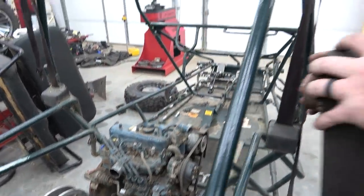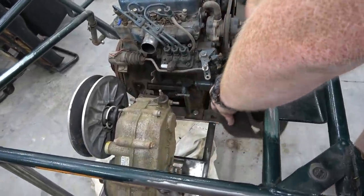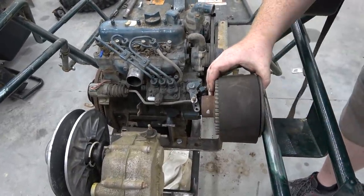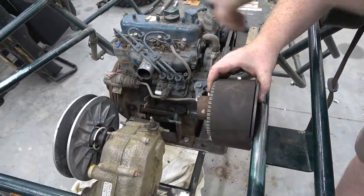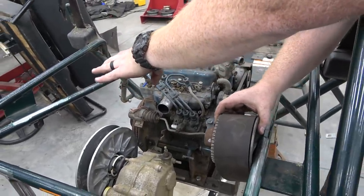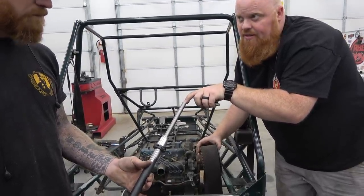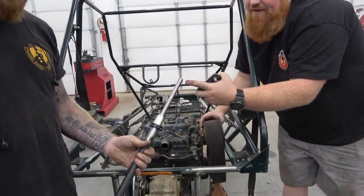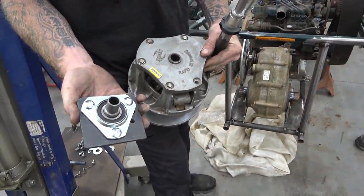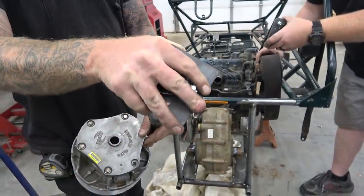So basically, we're making a jack shaft that's going to sit right here. We're going to have to cut this tube out because it's in the way to get this lined up. It's basically going to set somewhere like that, and the diesel Club Car pulley is going to set right there. Dave made this on the lathe. This is tapped for a 3/8 bolt, and he turned this down to 5/8. We put that little cone adapter, then he made that little slug that goes in the end that also sleeves on that, so it all sandwiches.